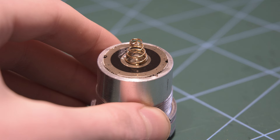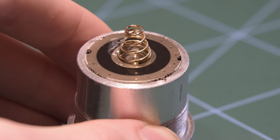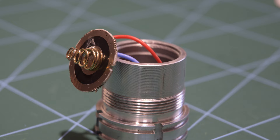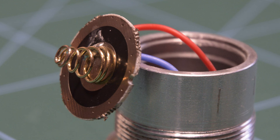Let's take a look at the existing solution. On the rear of the aluminium head insert, there's a PCB with two large exposed pads. The inner pad has a spring soldered to it, which will be the positive connection to the cell. The large outer pad is designed to make an electrical connection to the outer aluminium housing through the cuts on the side of the board, which works, but I'm not sure I'd trust that for super high currents — that's the first thing I want to change. Popping the board out shows just a pair of wires going to the LED, positive and negative. The tolerances on this board are quite tight if you want the friction fit, but hopefully that won't matter as much for us.